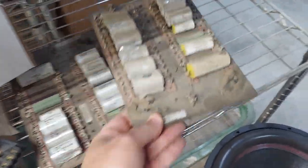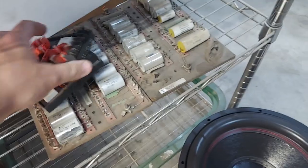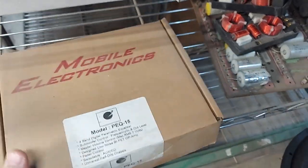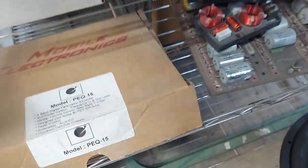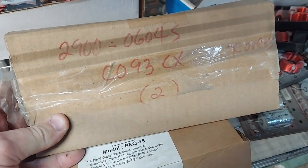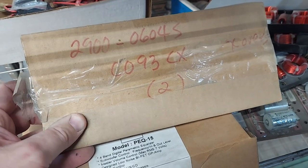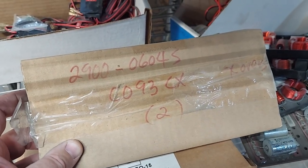Look at this — this is an old breadboard from ADS that they used to test crossovers. I got crossovers in here. Oh yeah, I got some of these cobalt ones too — these are nice. These were made in Tempe. That's the original part number — this is the coax cobalt 93693. And then we had some of the 6CS crossovers. These are pretty simple, they just have a little tweeter protection in them.